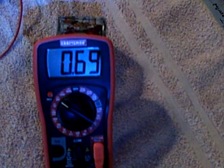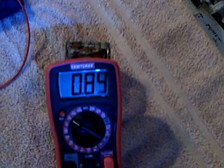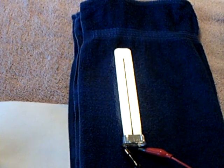That's what you want — if you're going to charge anything, it's got to be over the source voltage by quite a bit, otherwise it won't put anything into the charge battery. So let me turn this up a bit with the potentiometer and you'll see the CFL pop on now. There goes the CFL. It's not very bright, but you've got to remember, I'm running on one AA battery right there.